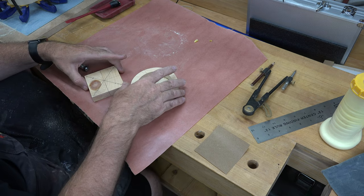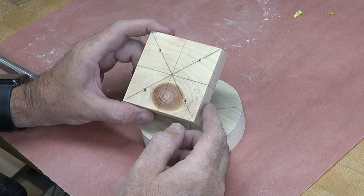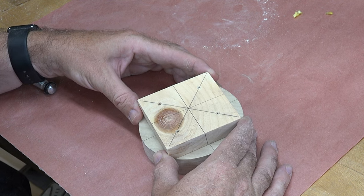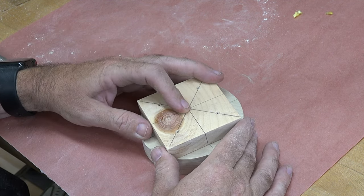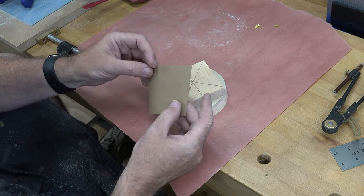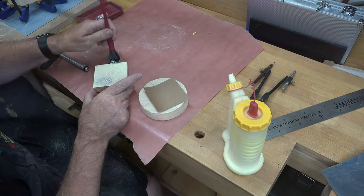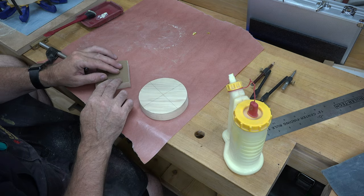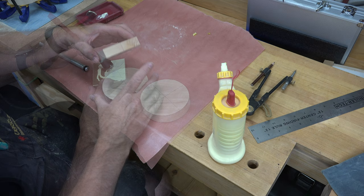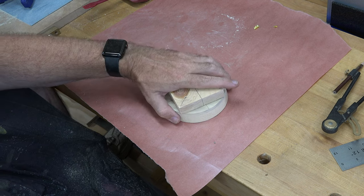The final shaping of this shaving bowl is going to be done on the lathe. I have a three-inch by three-inch piece of scrap pine — it will be garbage by the time we're done — and I'm going to glue it onto the bottom of our base, centered as best I can. To assist in removing it later I have a thick piece of craft paper from a paper shopping bag. I'll coat it with glue, glue it onto our three-by-three square of pine, then coat the back side and clamp everything in place to dry.